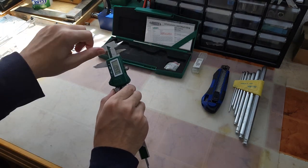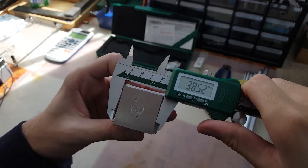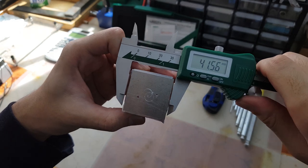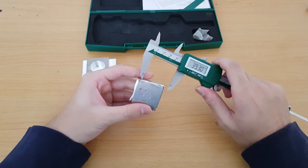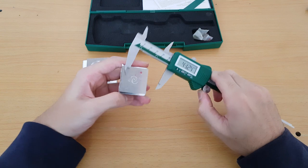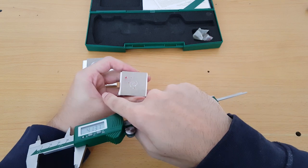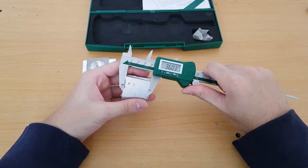When I got those results I was really happy, but that excitement didn't last long. I started measuring the part more closely and found some really weird problems. The part is about 10 over here, one under there. But when you measure from the start of the cut — the cutter moves clockwise — there's a 30 micrometer error. That coincides with a spike of error in the following error graph at the start of the cut.